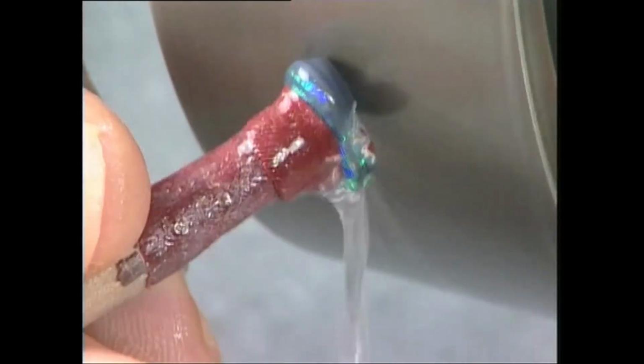Now, as with the other stones, after you've adjusted your water flow here, work on the high point of the back first, getting rid of the overburden, and as usual, when you get to the sand area, jump over it. There's nothing to cut there, it's a hole. Just bringing it up evenly, working at the angle that you wish to finish at. Jumping over that sand there, trying to get a nice straight edge.